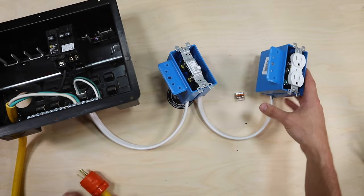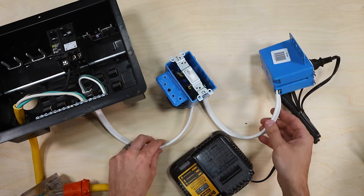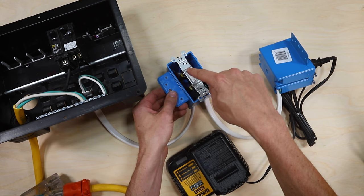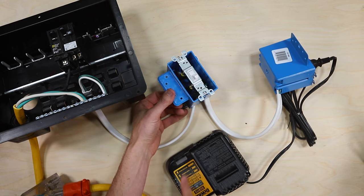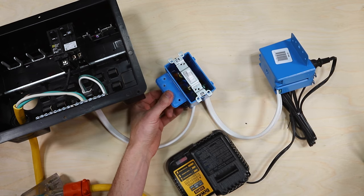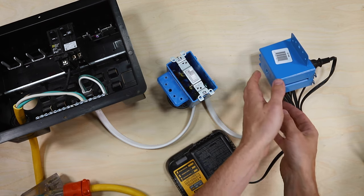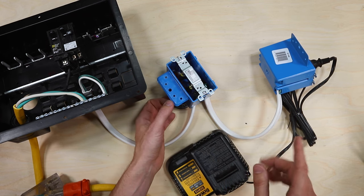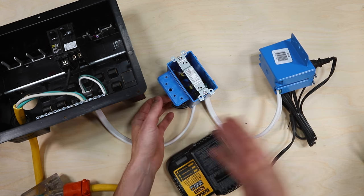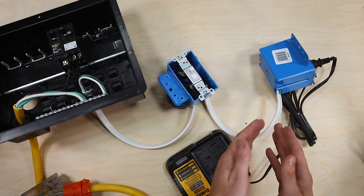That is all done. We have the green wire coming to all of the grounds, and the black wires with fork connectors going to the terminals — one coming from the breaker box and the other going out to the secondary outlet. Now I can put this back in place into the box like we did with the outlets. So we have our switch here and our outlet controlled by the switch. If you wanted to wire multiple outlets onto a switch, you would just wire multiple outlets the same way, but the switch would be the first thing in line.